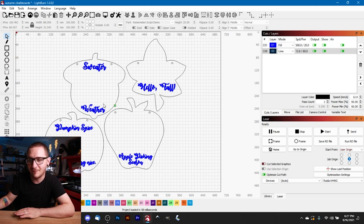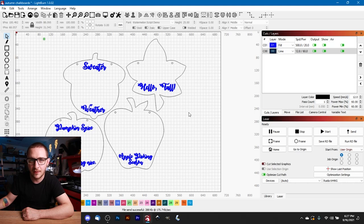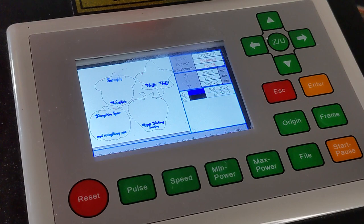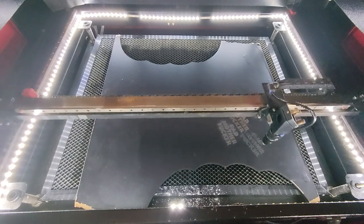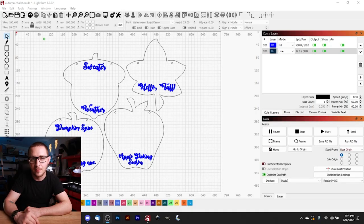We've got some prep and cleanup to do after these are cut and engraved, but let's go ahead and run this now. Start the job in the top left corner and send it over to the laser. On the machine, hit file and enter to load the file. The blue loaded in first, so we know it'll engrave before it cuts - if you cut before engraving, your engraving may not be centered. Since these are bigger than I remembered and coming off the chalkboard, we're going to load them in one at a time, starting with the pumpkin.